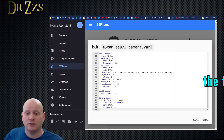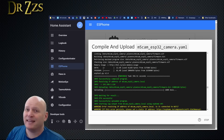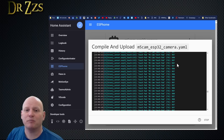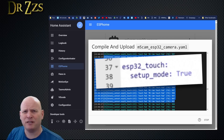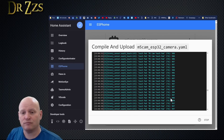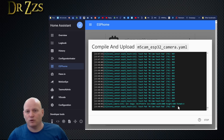To set the threshold, you actually need to load the sketch onto the board and start looking at the output. So now we're going to upload this sketch, save it, validate it — seems good — and then upload it. It can take a while for these to upload sometimes. Once it's finally done, if you leave it connected you'll start to see output. These numbers are from the touch sensor — this all shows up because we set that ESP touch sensor to setup mode true. Now if you touch the sensor you can watch it change.